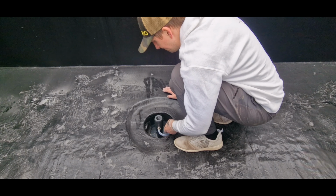In my rush to get the airline done, I put that pipe through there so that it's just going to connect onto the air pump, and I forgot about the 1-inch ball valve. So I'm just going to cut that in there and then fit that valve there, just in case. I've got it, I might as well use it.